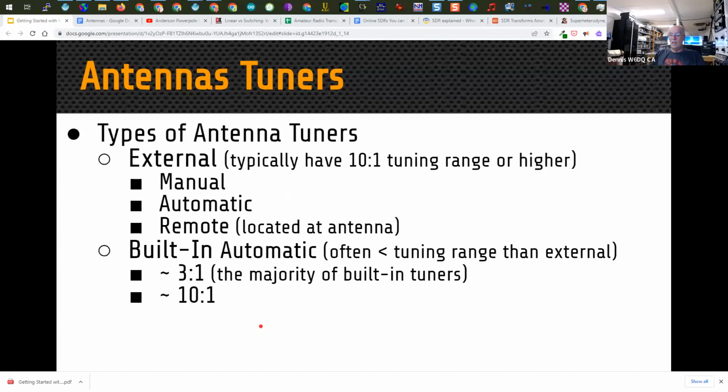One of the things that I will comment on is my take on putting together a station. Your station is a system. No one piece of it stands alone. Everything interacts with everything else. So your antenna interacts with your transmitter. The changes in your antenna will affect how the transmitter matches the antenna. So the tuner and all the feed line are all part of that system, from the transmitter all the way out to the antenna. So you have to be aware that those things are all interacting all the time. So this is something to be aware of.